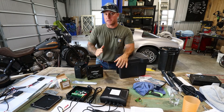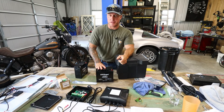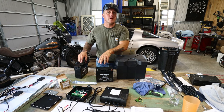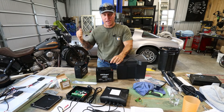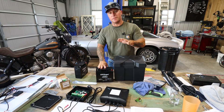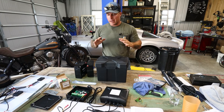The batteries are the only thing T-Opens does not supply in their kits — you have to purchase them separately. For the solar power system, you need a 24-volt, 17 amp-hour battery minimum. I got two 12-volt, 20 amp-hour batteries. We're going to wire these in series to make a 24-volt battery. These batteries will be stored in an outdoor weather-rated box I found on Amazon for about 18 bucks. I'll put the links in the description. We're keeping them off the ground to clear the lawnmower and weed eater.